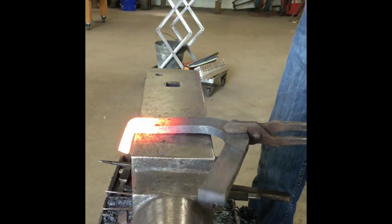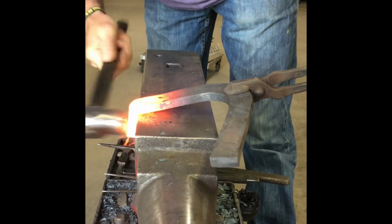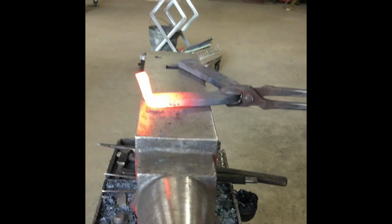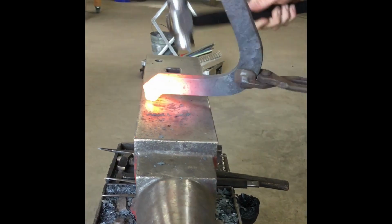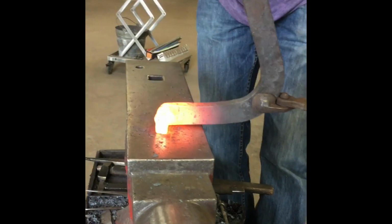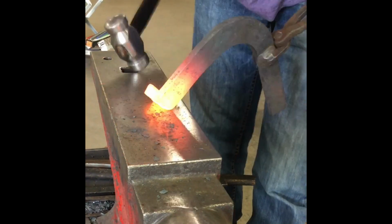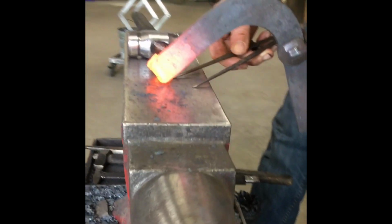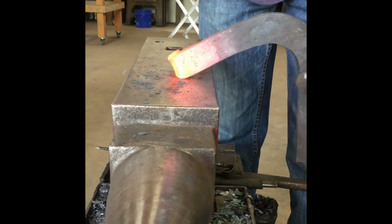We'll flatten this up, get this bend going in it. Now you can see it's leaning away, and I pull towards my shoelaces with the back edge of the stock. As soon as it stands up, I'm going to come in here again, not hit the front edge, hit the back, lift up high to where this is not touching, down here this is not touching, and then hit the back edge again.